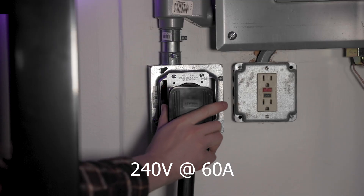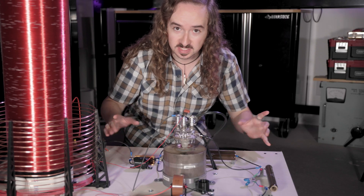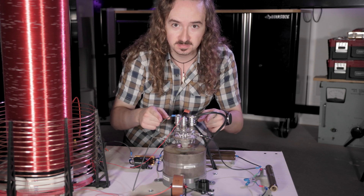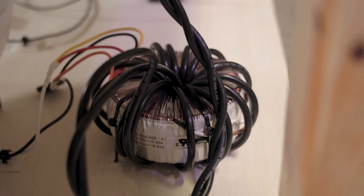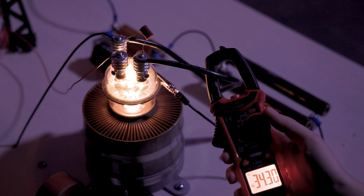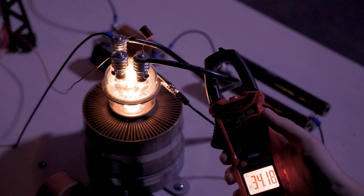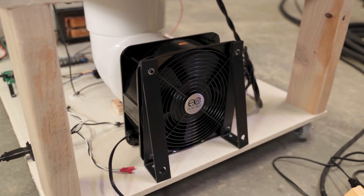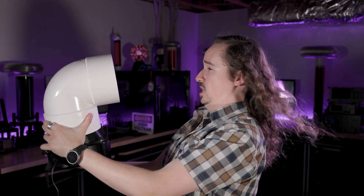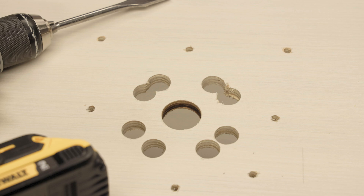We've got plenty of current to work with here. What makes this whole thing work is this massive vacuum tube. The heated filament in this vacuum tube requires a ridiculous amount of power on its own — I had to wind a custom transformer to supply 6.3 volts at around 34 amps. That's like 200 watts just going into the filament alone. This thing also needs about 200 cubic feet per minute of airflow for cooling, so I had to hook up this ridiculous monster fan. That's what those holes I drilled in the wood are for.